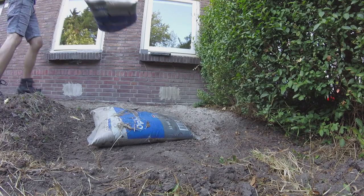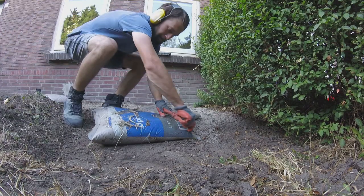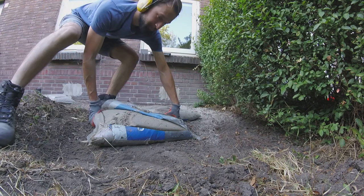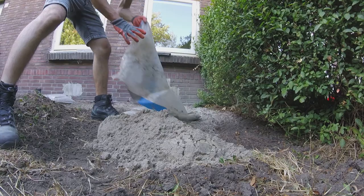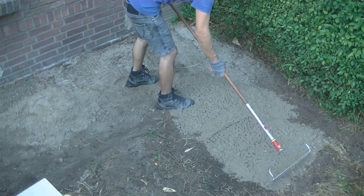After that, low spots will be filled in with sand. The sand is quite sharp and stacks nicely. This stabilizes the pavers on top. The sand gets evenly spread over the area, and it's handy to use a level if you're unsure.